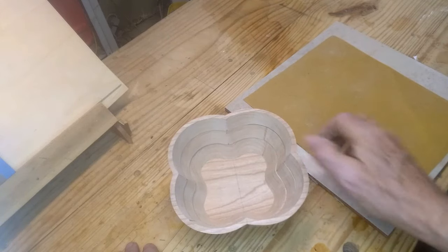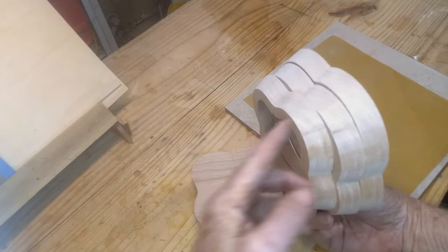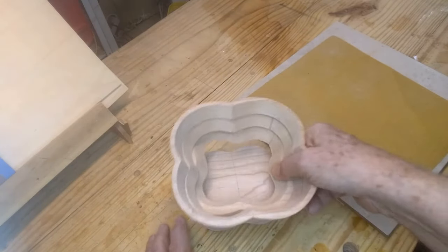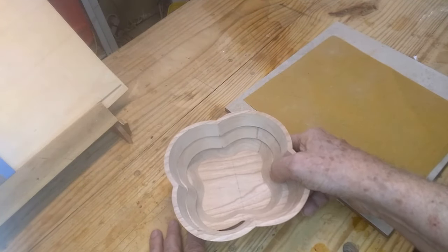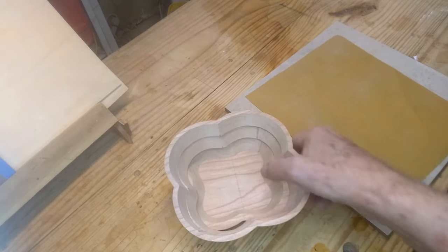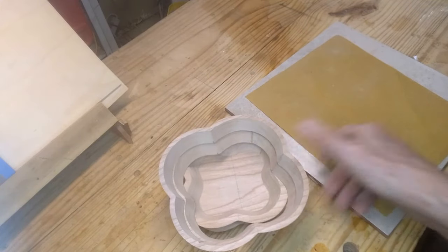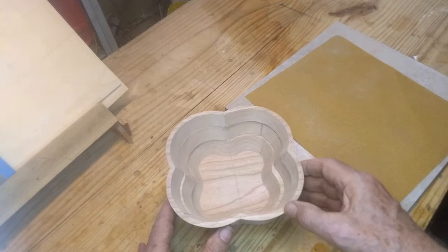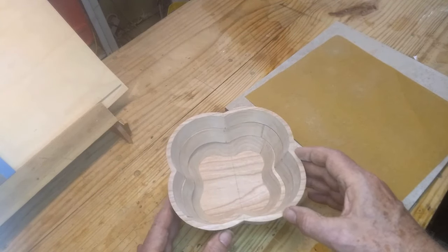The problem is, then if you don't match up between this ring and the base, that's two very rigid pieces of wood, and it's very difficult to get that out. You'd have to do a lot of sanding. So it's just easier to match each one up. It takes minimum sanding to do that, and it makes it much easier to get the base on without a gap in it. At least that's my experience anyway. So let me work on this, and then I'll glue it up.